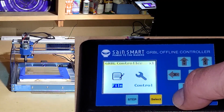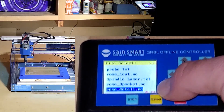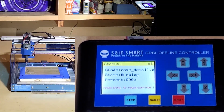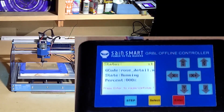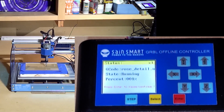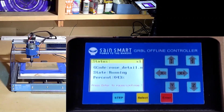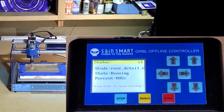Now we'll go to file, go to the detail - there it is, last one. Just hit select until you get down to it, then enter. Now it says stop. Press enter again - running. Press enter again - pause. Press it again - running. You could fix that up in G code, I normally don't. I think it's a good moment to double-check: did I tighten everything, is everything set the way I want? That little bit of pause makes me double think and make sure I did everything, like set the X and zero and the G code to go back to home when everything's done. This is the first time using the engraving tool to do a pocket - I think it came out pretty good. I always turn off my machine and then turn it back on.